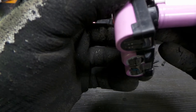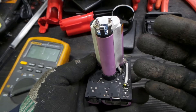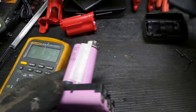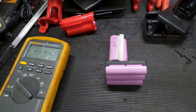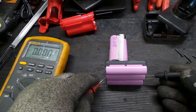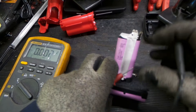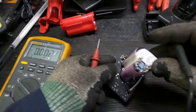I'm going to try and put this on a charger and see if it wants to charge as-is. It does not want to charge. Remembering that we're on a rubber mat — always be on an insulated surface when you play around with these things. We're going to turn our meter to DC volts — polarity doesn't really matter, we just want to look for voltage. 3.5 — that's somewhat discharged but not bad. 3.8 — not scared with that. 3.8 — so that one is a little lower than the others nominally.